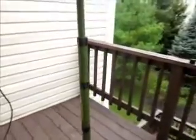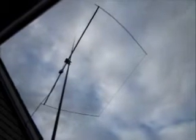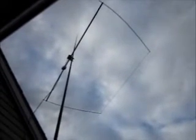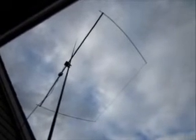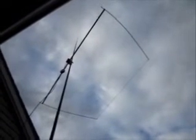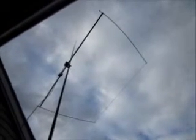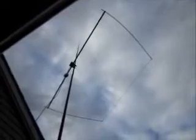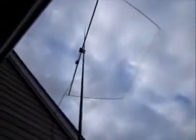I got myself a 1.1 SWR on about 1875 kHz or so, so I decided to go in and just listen and give a call, and that's when I worked IZ2GRG. Got a heck of a surprise when it came back with a 569 report for my 5 watts. And then when I switched over to the 44-foot doublet, I could hardly hear the guy in the noise, which is truly amazing because that 44-foot doublet has been my antenna of choice for DX for about the last three years.